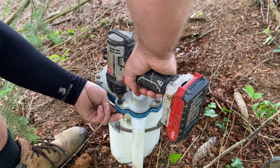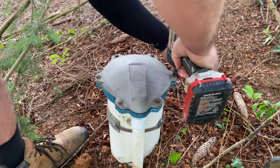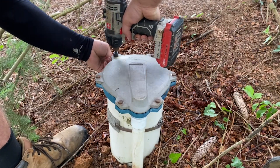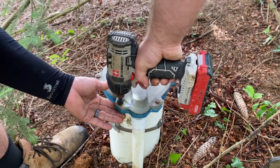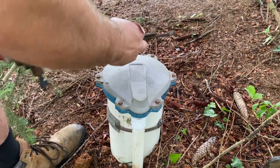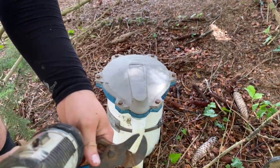We've got everything back where we want it. I'm going to go ahead and reattach this lid, and then we're going to go back down into the basement to make sure we run all the water throughout the house. Whenever you're doing a chlorination, it's very important to run the water through all of the cold systems in the home so you can let it sit. We usually like to let that chlorine water sit for about 24 hours before the runoff.